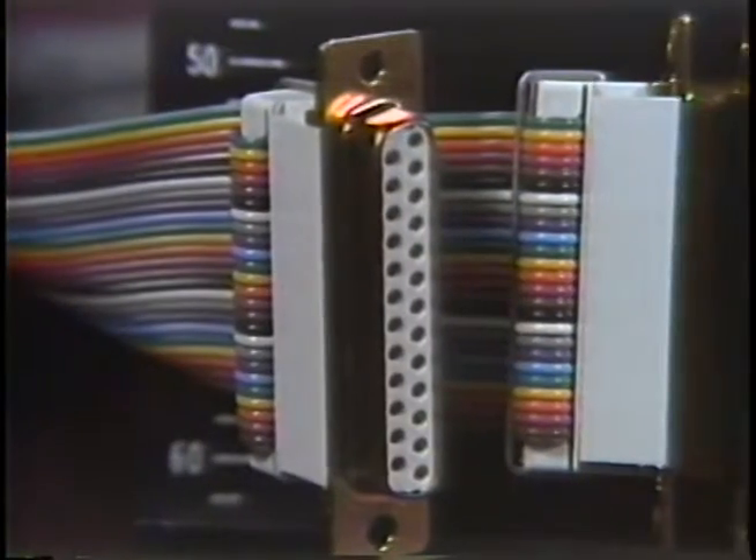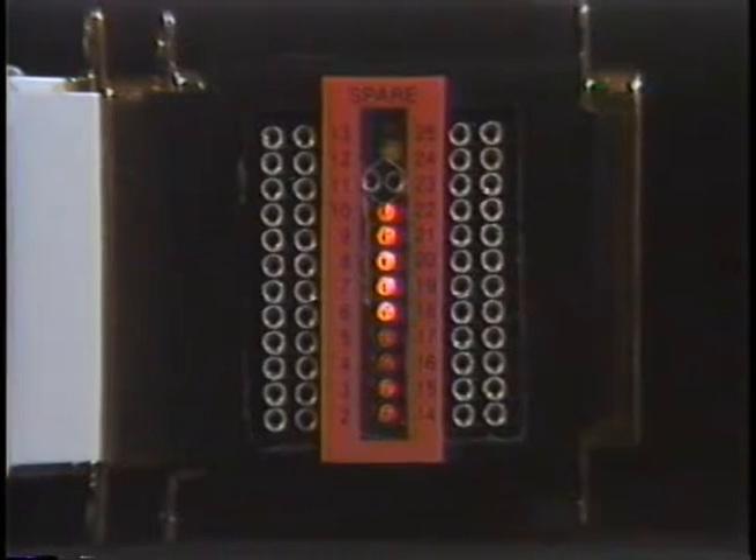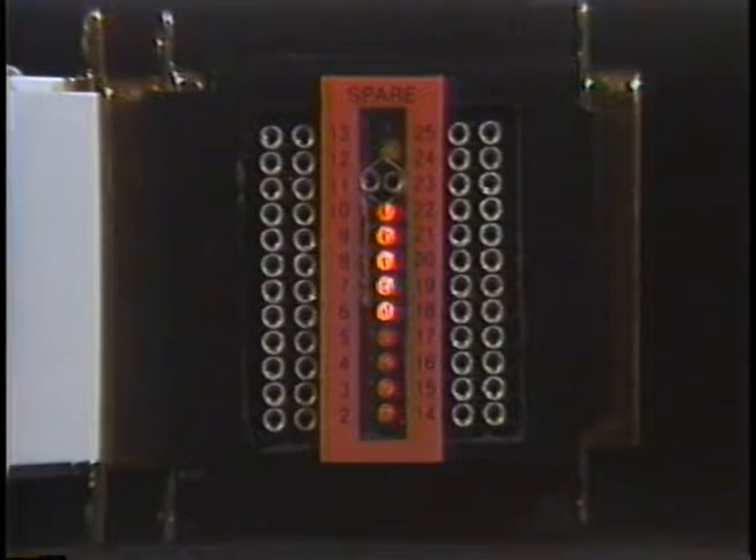Hello, and welcome to Data Communications Brokers' videotape on RS-232 and the use of the PBOB, or Pocket Breakout Box. The PBOB is used in RS-232C cables. The lights or LEDs indicate which signals are active. This in itself can solve many mysterious datacom problems.